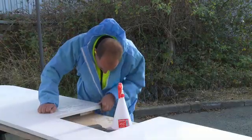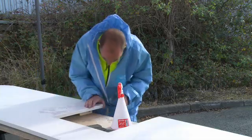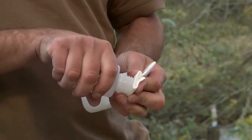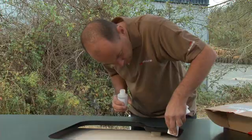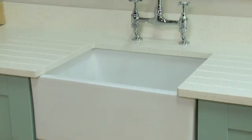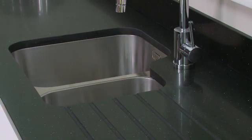When sanding the front corners of a Belfast cut, extra care should be taken to blend the new face with the factory finished one. Darker colours of M-Stone can dry a shade lighter after cutting. This is normal, and the finishing polish from the installation kit is supplied to restore the colour. Apply 2 coats with a clean cloth, allowing to dry first. Extend onto the factory finished edge if necessary to blend. Allow the resulting edge to cure for 24 hours before general use.